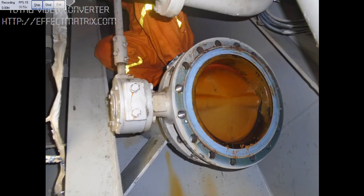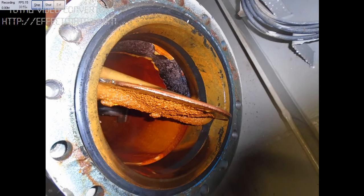This is the seawater valve — I opened it. You can see the corrosion over here and the hole. The main reason could be that the valve was not opened fully, due to which cavitation had occurred and the hole has formed. In order to avoid such problems, always keep the overboard valve fully open.